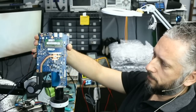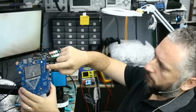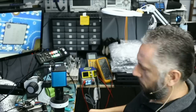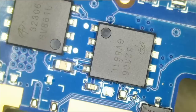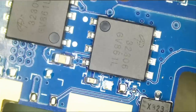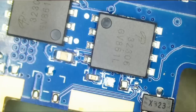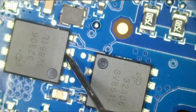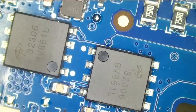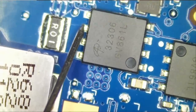Right now, if you look at the board, it looks something like this. The charging cable plugs in here, and we want to look for the power MOSFETs — we have two of them right here. I want to inspect the MOSFET area and see what's going on. Meter in diode mode. 0.64 reading. Here we're going to get something in the mega ohms or OL — we're getting OL. We're going to have about two voltage drop here. Do we have a short on the gate? No. Do we have a short on this gate? No. Do we have a short at the drain? Look at that — we have a short here at the drain.